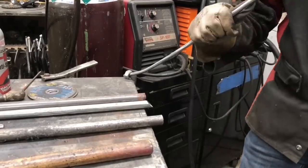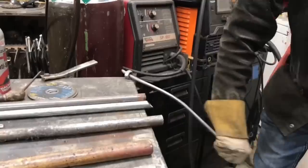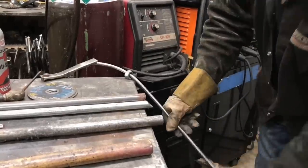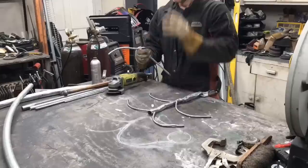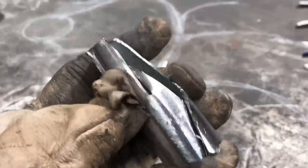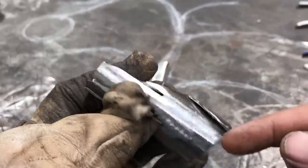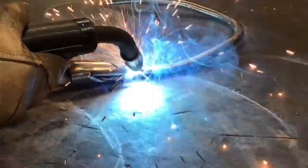Throughout my welding table, I'll weld different sized nuts as well as different diameter pipe. I use this technique whether to hammer on or, as I'm doing right here, taking different solid rod and bending and shaping it to what I need in the project. Right here, I took that same inch and a half pipe from the main trunk part and cut it down so I can hammer it. This is a transition piece from one size pipe onto the next transition, which is going to be this 3/8 rod.